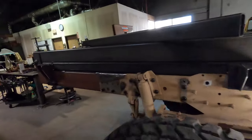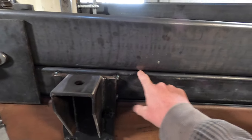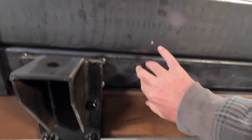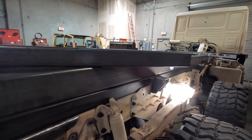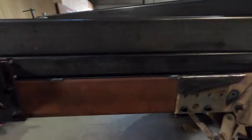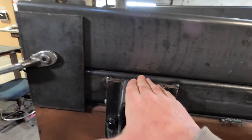These spring mounts are pretty cool. The way we're doing this is in between these two pieces, we're going to have a three-quarter inch thick piece of rubber that's going to run the length of that. So this is just a spacer off the frame, and this is the subframe, and then these are the cross members. This is basically going to go this way and those are getting spaced out. Up here I'm building a piece that sits down flush with this and puts that space in.